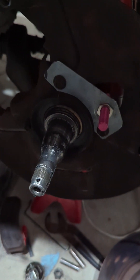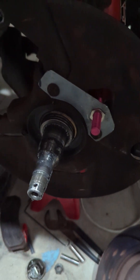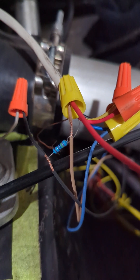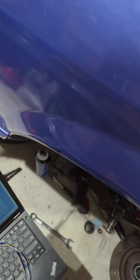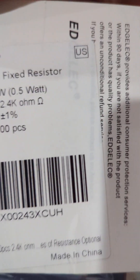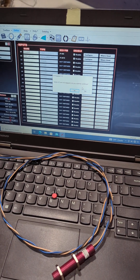It also takes a pull-up resistor. I've got this temporarily wired in now, but the pull-up resistor goes from the power to the sensor wire, and this is a 2.4k ohm resistor — I just bought a box of a hundred because it was easy off Amazon. Anyway, I hope this helps. If you have any questions feel free to leave a comment. Have a nice day.